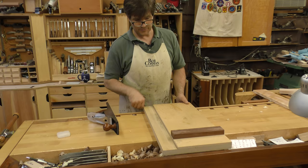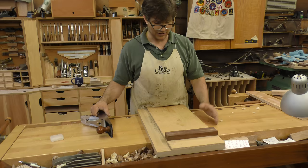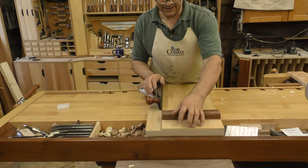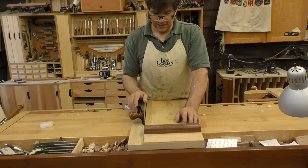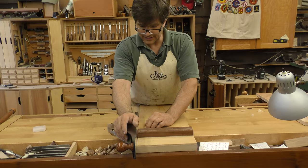Now, a couple of issues — I'll start with a minor and end with a major. I've always seen shooting boards with the fence back here, and the problem is when you're teaching new people to do this, they would always be moving their plane around as a result. So what I did is I brought my fence up here three or four inches, so that when you bypass your workpiece, you still have some registration area to keep the plane going nice and straight. Just overall made for a more accurate experience.